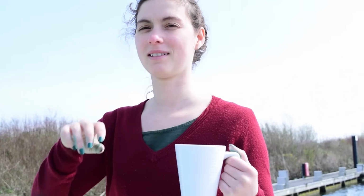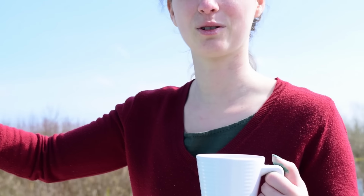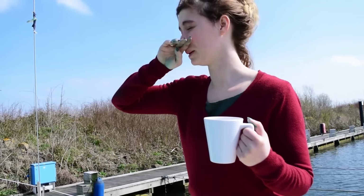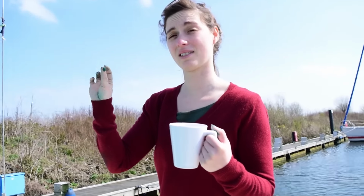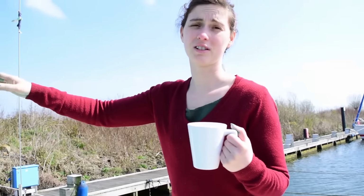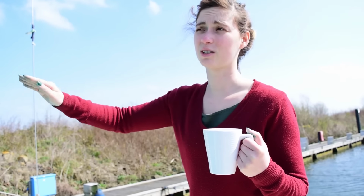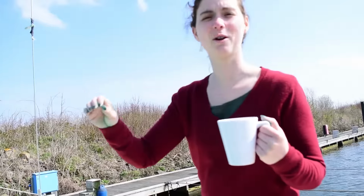I just finished doing the second watered down coat of paint with thinner in it. On this side the depressions were much deeper, because when I pulled off the letters, all the coats of paint right down to the base coat, the primer, had come up, so there were many layers of paint that had peeled off. So that one I've done 2 coats after sanding it, and now I'm going to have to sand this again, and then put on a thicker coat of paint, not thinned out. A thin coat of thick paint.